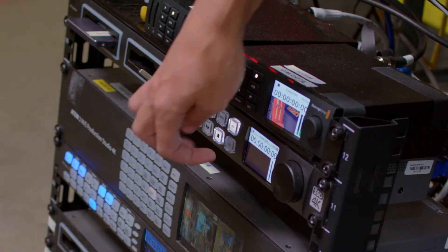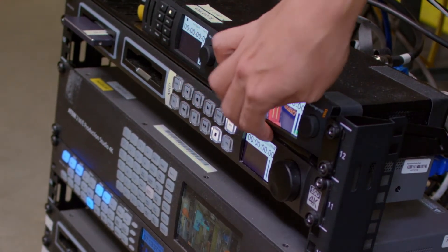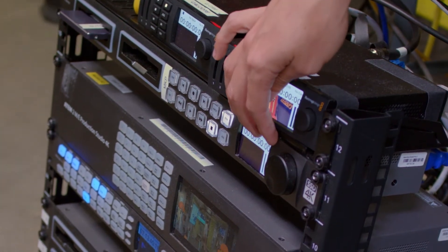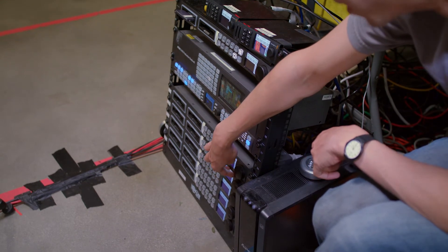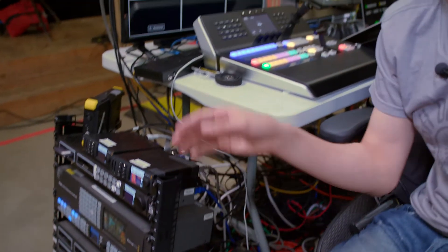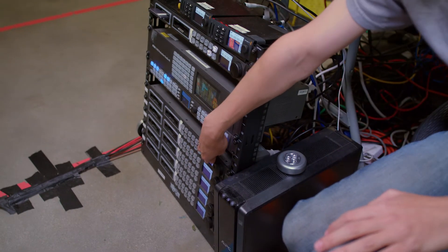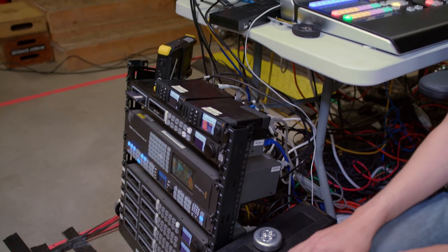We have a lot of Hyperdecks — five different Hyperdecks. One of them is handling playback and that's actually this guy up here, a Hyperdeck Studio Pro 6G, so that can export audio out to our sound guy. Then the rest are Hyperdeck 12Gs and these record all of the ISOs from the Ursa Minis. They pass out via SDI loop out into my switcher, so it's basically going into these to record on solid state drives and then coming back to me. There's no delay going into my switcher, and we still get to double record in-camera and then out of camera here again just to preserve our assets.